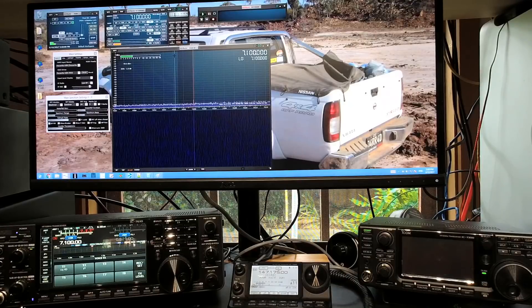I'm not going to be doing a standard two-tone test. I don't really believe in them — I don't think they give a good overview of a transmitter's real performance, and I think they're very easy to fake and skew. What I've done here is made a recording, and it's going to be the same recording each time. I'm going to vary the transmit bandwidth, and you'll see right on the screen in front of you what the output looks like.